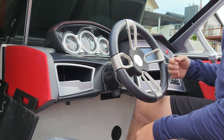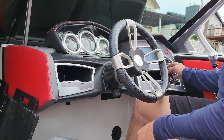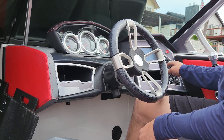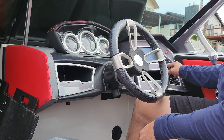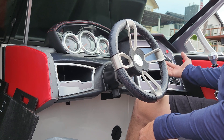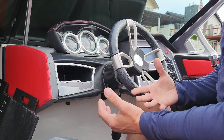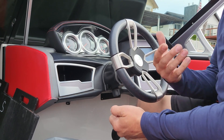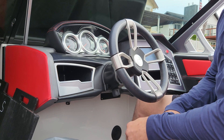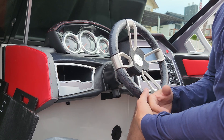So we have his dash on right now and it also has the manual options. I know the port tab is working but it's not going down all the way — it's been failing on him, so we're replacing that one. For the starboard side, if I press down, this one is not working at all. It's completely out. My diagnosis will be taking the new actuator, plugging it in, and hitting the button. If it works, we know the actuator has failed. Today we're replacing two actuators.